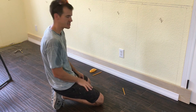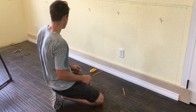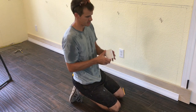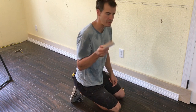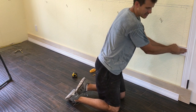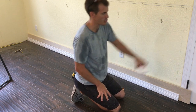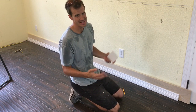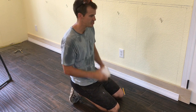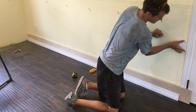To its width, and now we're just deciding the length. So I'm going to mark it up here on the wall, and then make it easier this way. So I push it all the way up against the wall. One thing I know about this size material, this 1x material, is that it's going to stick out past my casing of my door. That's not good. You don't want anything on your walls that's trim work wise to stick out past casings on doors. That's why your baseboards are all thinner than your casings on your doors, or they should be. It's supposed to be like that. So this is not so good.